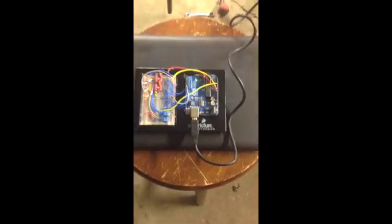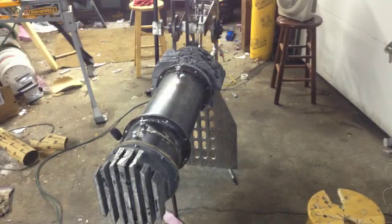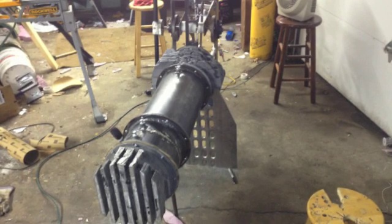At the hot end you can see we're just getting the sensors fitted. We've got basically a pressure sensor up here, a temperature sensor, and an analog pressure sensor. We also have another temperature sensor in the back towards the cold end. We're going to take these sensors back and run them into our Arduino circuit, which you can see on the laptop here.